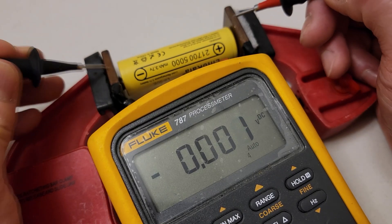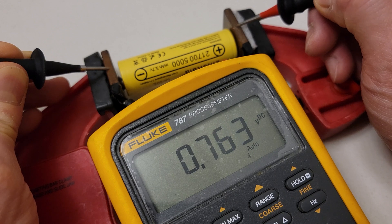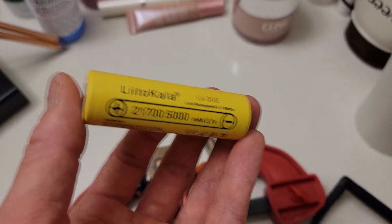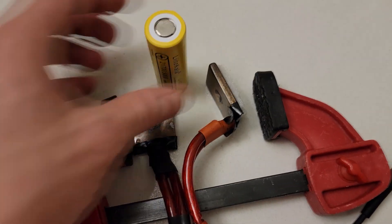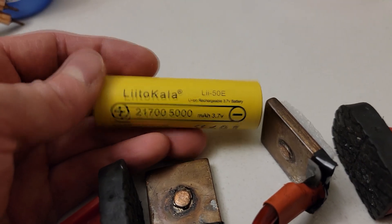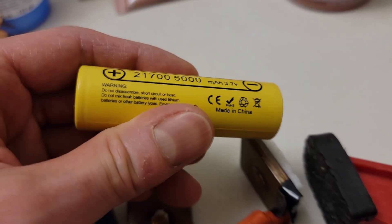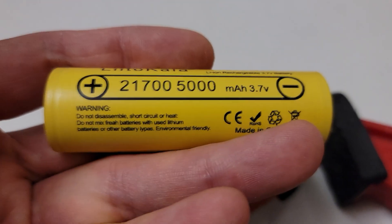It's just a quick spark, but after that spark the fuse is gone and we're only seeing 0.7 volts. So these are well-built cells with a good safety measure built in in case you get a short — it doesn't go into thermal runaway. It just opens the circuit and saves you from any fires or thermal runaways. It's a very well-built cell with safety measures built in. Definitely do not try that at home.